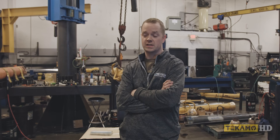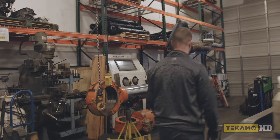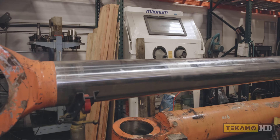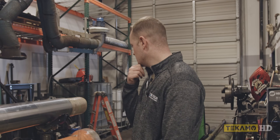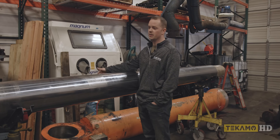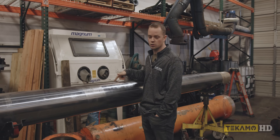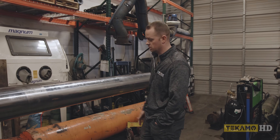The biggest thing is the EX3600 boom cylinder — that's the mining excavator. I have one here. There's two of them; they're inverted and they go on the EX3600. We had two; one's left the building and we're just working on getting this one fixed up. This was a pretty basic rebuild. The inner bore is 3 thou out of tolerance, much the same with the inner bore on the barrel. Whoever did it previously just put in new bushings with the inner bore being 3 thou larger than the housing dimensions on the SBB bushing. So we're going to fix that up.